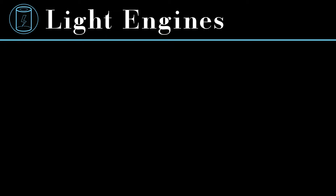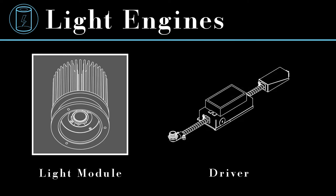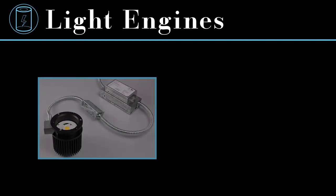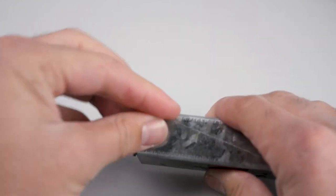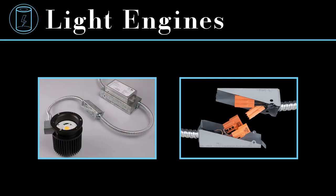The CDA system is designed for ease of installation. The light modules and drivers ship in separate boxes, allowing for the driver to be installed prior to finishing the ceiling, painting, and other activities in new construction, while the sensitive light module is safely stored in a clean, secure location. Flexible metal conduit whips on the driver and light module make final installation a breeze with luminaire quick connects — simply mate the connectors, install the set screw, and you're done. The driver also features FMC with line voltage and 0-10 volt lines for ease of installation in any of the CDA-4 housings.